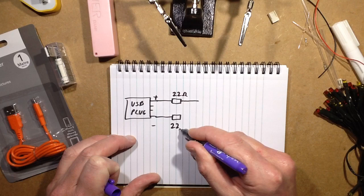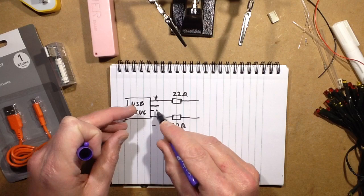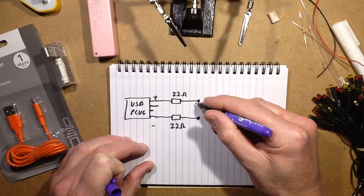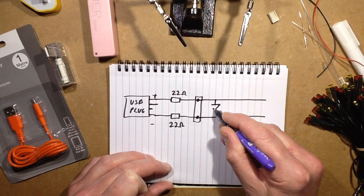The reason for using two resistors is for safety and power dissipation reasons. I'm taking those two leads out, and there are also two cores for data which I'm going to cut at slightly different lengths so they don't touch each other, and we're going to be sleeving them to stop them being shorted out. This is going to a plug — you don't have to take it to a plug, it could connect directly to lights.